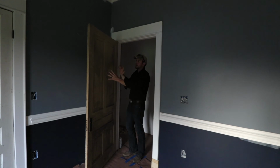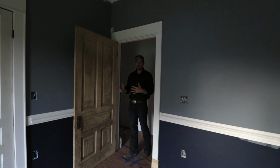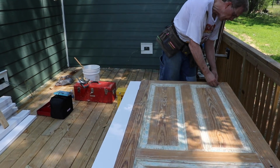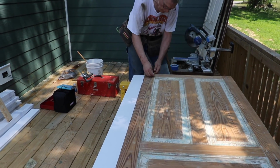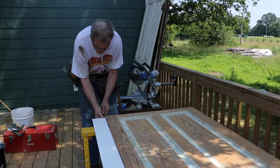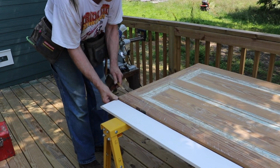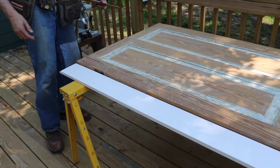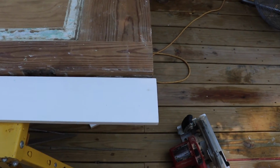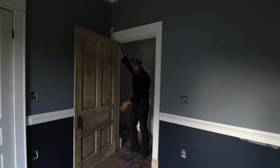So rolling ahead, once you have the door plumb and square and perfectly cut, the next step in this process is aligning the door with hinges, because at this point the door jamb is a clean slate. There are no hinges. You're going to have to use a router to put the hinges on the door jamb. So you're going to lay the door flat and again measure out, kind of set one side of the door jamb down and figure out where the hinges go, so that again you have about 1/8 of an inch on the top and 1/4 of an inch on the bottom.